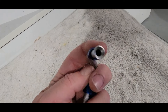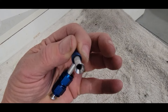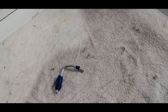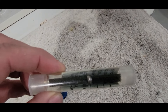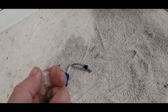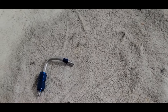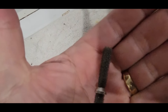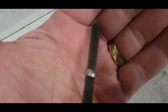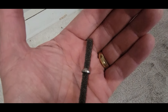We can't really see anything wrong with this flare, and looking at the flares on the adapters in there, they look fine. So what we're going to do is put in a conical seal for flares. We'll get this back installed — with this conical seal, it's basically a piece of metal fashioned into the same degree and size as a tube flare. We'll get this installed and hopefully that will solve our leak.